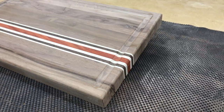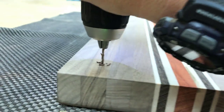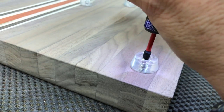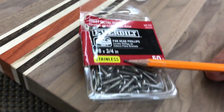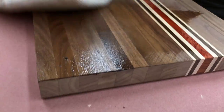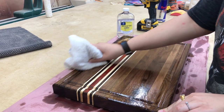There's a preview of what it looks like rough before any finish goes on it. The next step is to put some rubber feet on the bottom so it doesn't slide around — we have to pre-drill the holes for those. You can get these feet at just about any hardware store or big box store; I'll put a link in the description. They cost about $2 for a pack of four, but the regular screws they come with are not good enough for a cutting board — you need stainless steel screws so they'll never rust in a wet environment. For the finish, we're just going to use food-safe mineral oil — a few coats until no more will absorb in, then a coat of mineral oil and beeswax at the end to condition the board. And that wraps up the project.